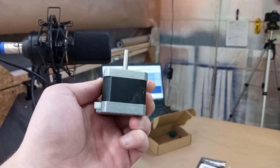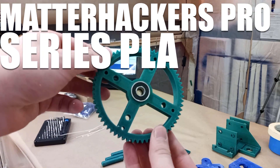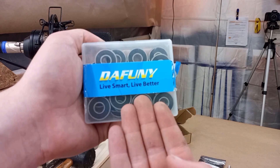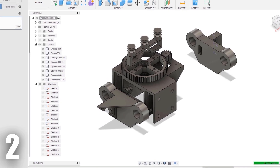3D printing came through in two distinct ways: as my primary manufacturing method, and by harvesting parts from an old 3D printer for smooth motion. All the green 3D printed parts were made from Matterhackers' Pro Series PLA, which they graciously sent me for free. I'd highly recommend picking some up — link is below. The most notable non-printed parts are the three-quarter inch copper tubing, which acts as rails and structural backbone, and 19 skateboard bearings that roll on the copper tube to create ultra-smooth motion. I then fired up Fusion 360 and started designing a slider with two axes of motion.